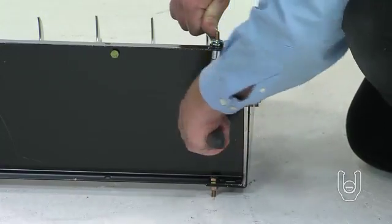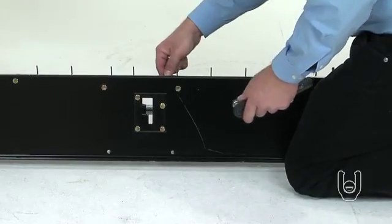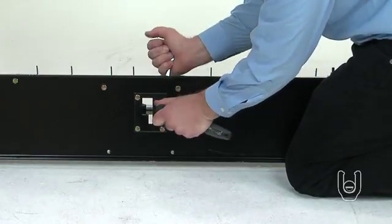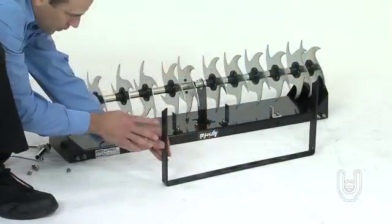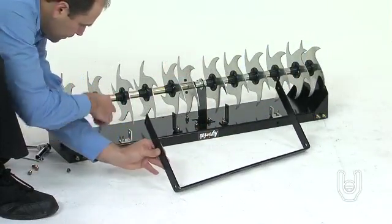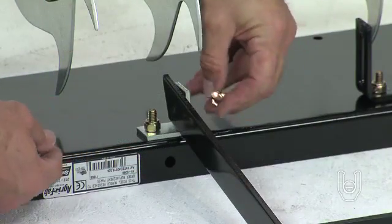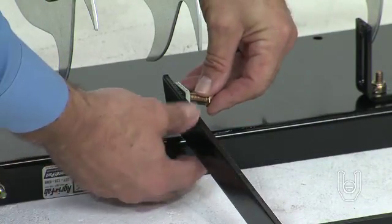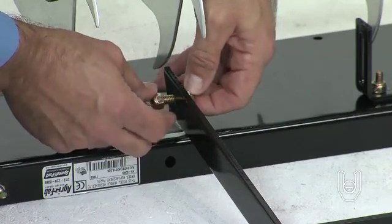earlier. Next, square up the axle support bracket Part 5 with the tray and securely tighten the 4 bolts that were loosely attached to the axle support bracket and the lift plate. Now assemble the wheel mount bracket Part 9 to the outside of the angle brackets that are already attached to the tray. Use 2 hex bolts Part D and 2 nylock nuts Part G to secure the wheel mount bracket.